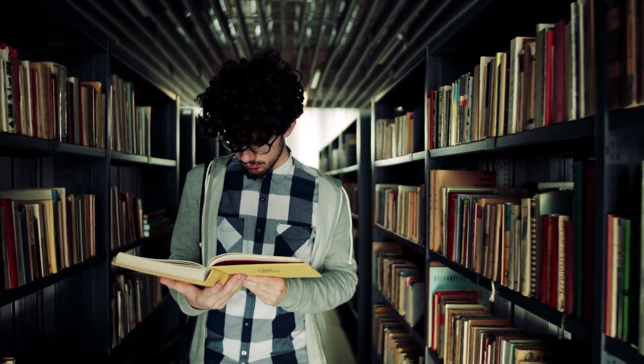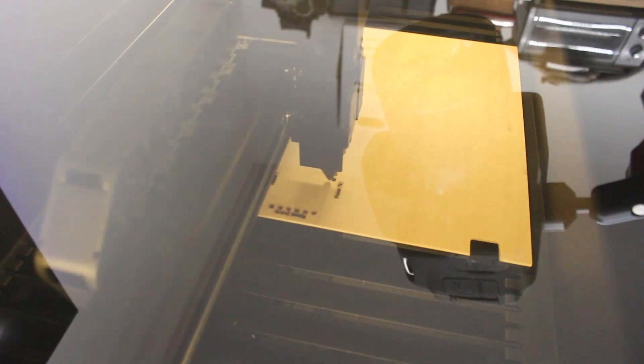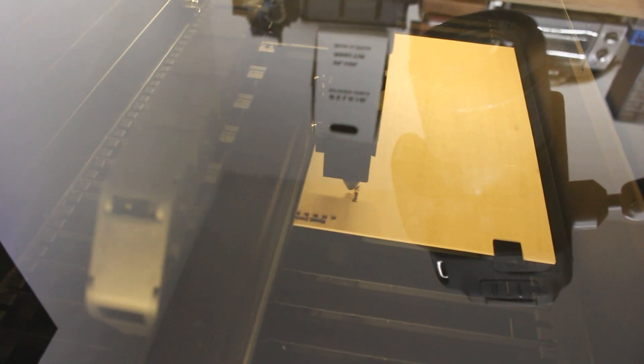The wavelength determines what materials you can cut and engrave. Before I talk about what materials each laser type can cut and engrave, let's talk about the learning curves. A laser engraver can pose a bit of a learning curve, especially if you've never used a CNC machine before. It requires special software on the computer to control the laser, and you need to learn what settings work best for your specific material.